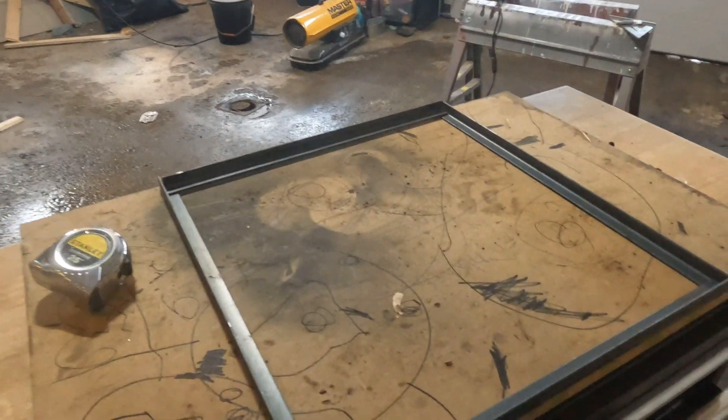So far they're looking pretty good on the inside, and they are all done. I'll cut and tack my expanded metal in and then be ready to put some hinges on. I haven't decided if I'm going to bolt through this or actually weld the hinges on and then just screw them to my wood frame — I'll cross that bridge when we get to it. I got my expanded metal all laid out, ripped down through there, with one piece on each side. I mis-measured at first — just gotta be mindful when you take your measurements. I want the longer direction facing upwards; I think it'll look better. Lay them down in there and we'll start.